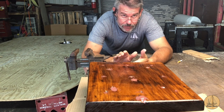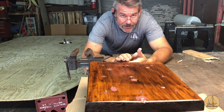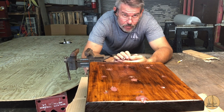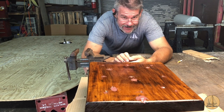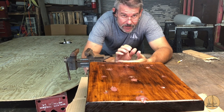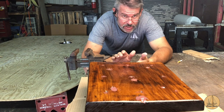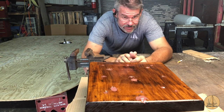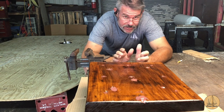What's really going to happen now is tomorrow they're going to be able to put this mast step on. I only have one coat of varnish over the top of the epoxy, and I will have to apply a few more for good UV protection. What I'll end up doing is probably early tomorrow morning, coming down, sanding it with 320, letting it get bedded onto the boat, and then eventually I'll tape this off in the next few weeks on the boat and apply varnish just on the outsides of it. The good news is it's all protected with epoxy, which is really important to me.